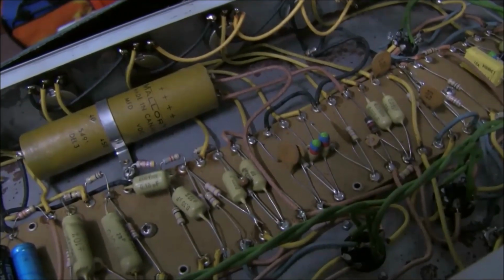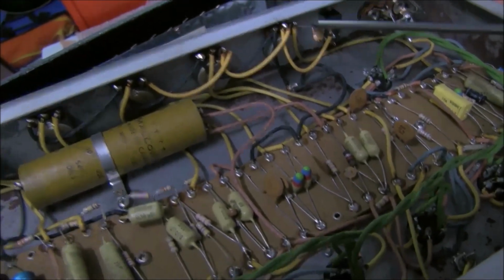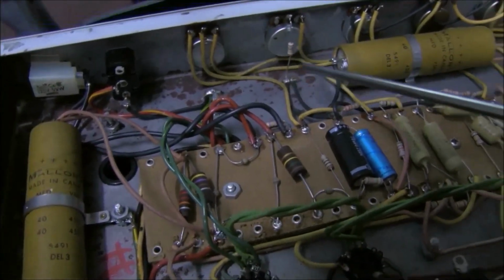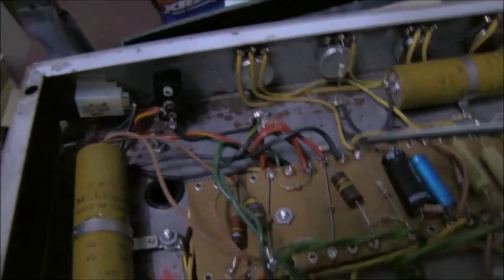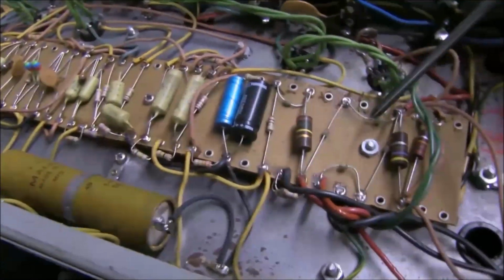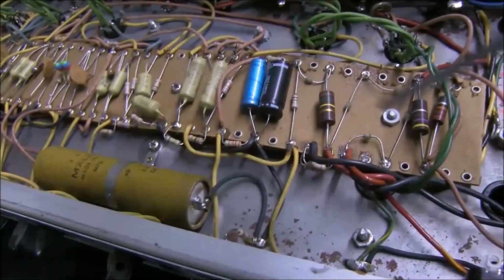There's a bright switch capacitor there that obviously bypasses just across the volume control when switched in or out. All the controls here are original. The lamp says 125 volts, was obviously 250 volts, but maybe they put a resistor in series with it. The diodes here, 1, 2, 3, 4, just arranged like in a bridge there, whatever make they are, it'll be on the circuit diagram.